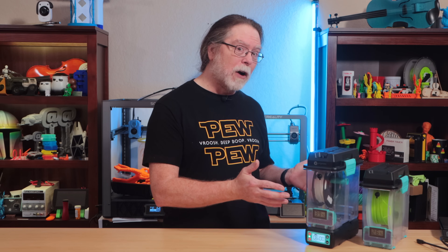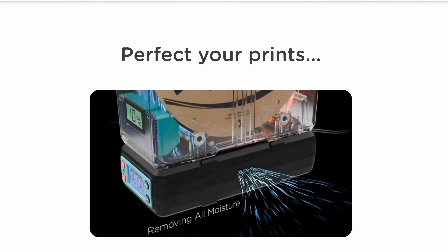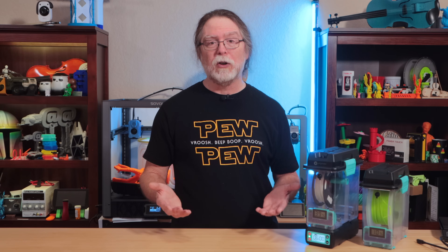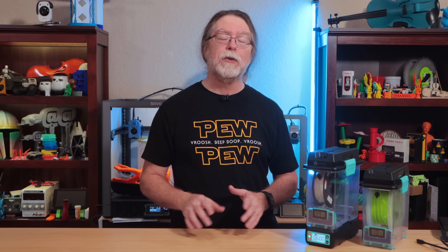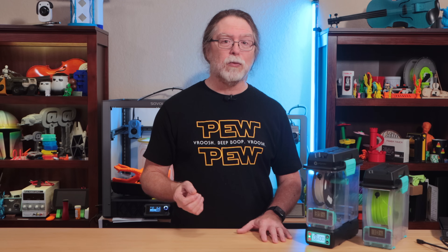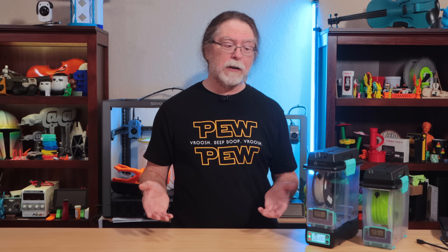Now that you've seen the before and after prints, let me go over what I like and don't like, starting with what I like. I like the modular system that separates the drying function and the storage function. Unlike some dryers, the Dry Dock does have air exchange with the outside through small vents on the side, so it's able to vent out warm, moist air while drying. It can run a timed drying cycle up to 24 hours, or be set to continuous mode. I like that the PolyDryer box includes the desiccant and hygrometer, and I like being able to directly print from the box. I also like that the PolyDryer box includes a spindle to hang the filament by its hub inside the box, so even if your spool is small, narrow, or has a damaged rim, you can still print with it from inside the box.